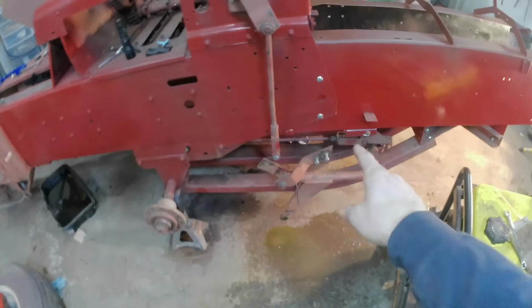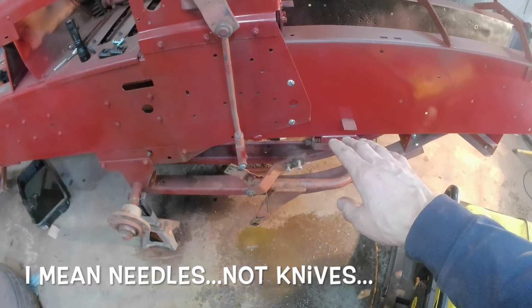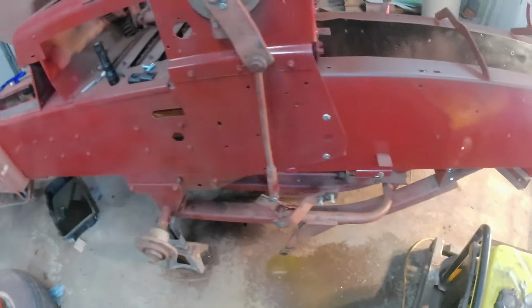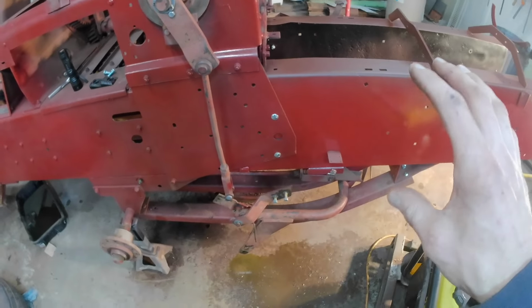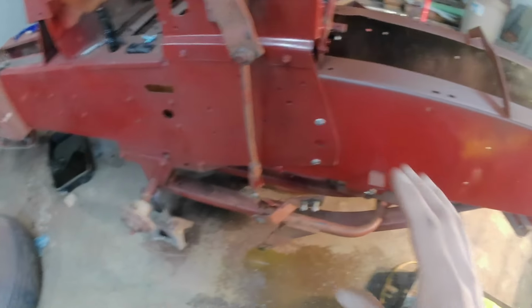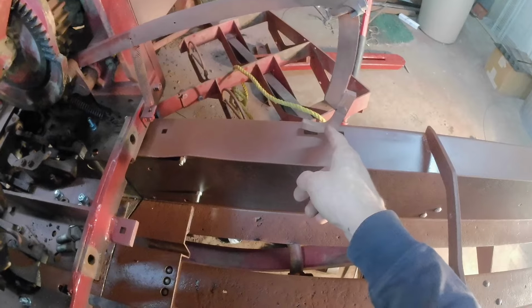One of them is that the knives are mounted to this plate and that uses the old mechanism, but if this back isn't straight or square, now it helps that I have this plate here. I'll explain that in a second. But for example, the metering wheel mounts on the old piece, so if this dimension is different, now I've got a gap issue here that there's really no adjustment for this arm. It's just in or out. I could cut it and shorten it if I had to, but it just needs to be the same, and it needs to be square.